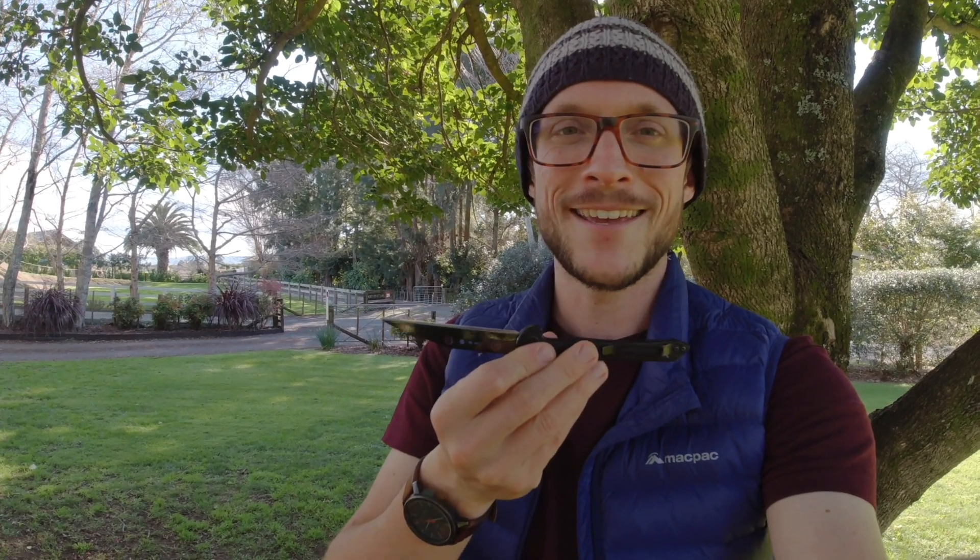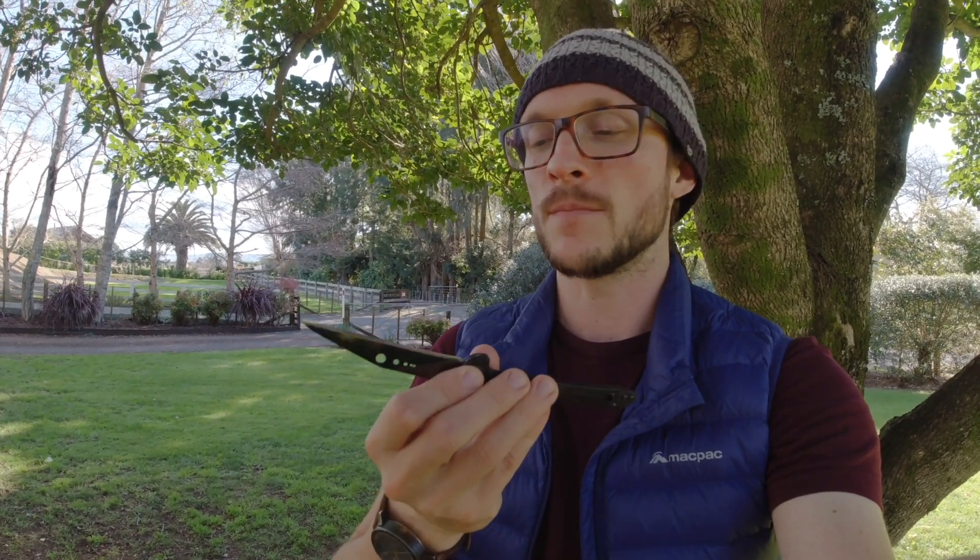During the video where I try the different stones and sharpening methods — edge trailing, edge leading strokes, different stropping methods — I began to sense out some general guidelines. The way that you sharpen tungsten carbide is very different from the way that you sharpen steel. The main reason for this difference is ductility. There is very, very little or no ductility in a tungsten carbide knife. Ductility — being able to be formed, bent, or stretched — is a property that gives steel the ability to take a really fine apex or even form a burr on the edge. Tungsten carbide doesn't really form a burr and doesn't have the ductility to maintain a super fine edge with most conventional stones.